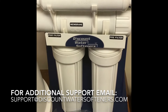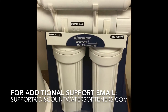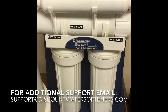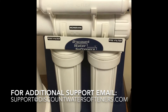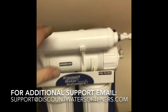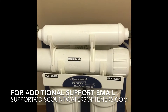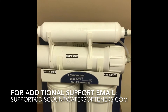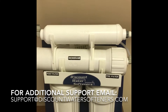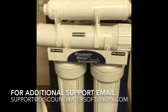Hi, we're here again at Discount Water Softeners with a quick video on how to change the reverse osmosis filters and membrane on either our four-stage or five-stage reverse osmosis systems. The pre and post filters should be done about once a year, and the membrane can be done every two years — or every three years if you're a household of maybe two people. But if you have a household of four or more, you may want to consider replacing the membrane every other year.